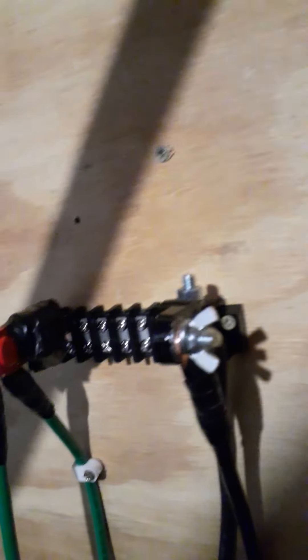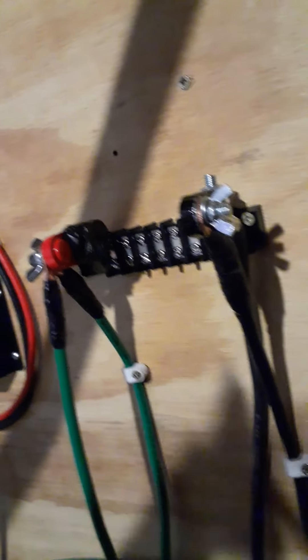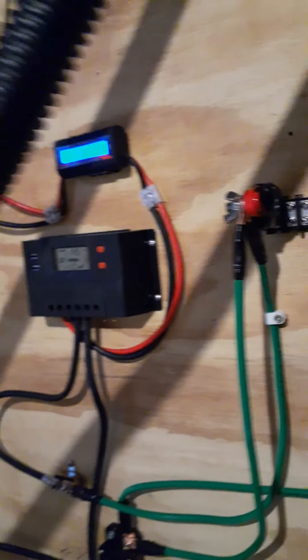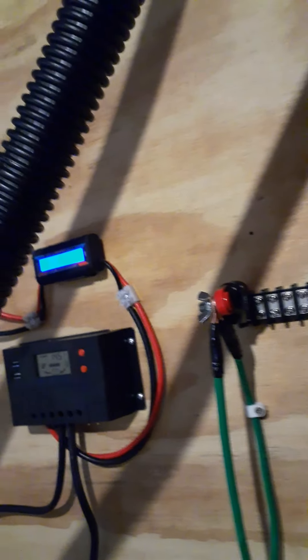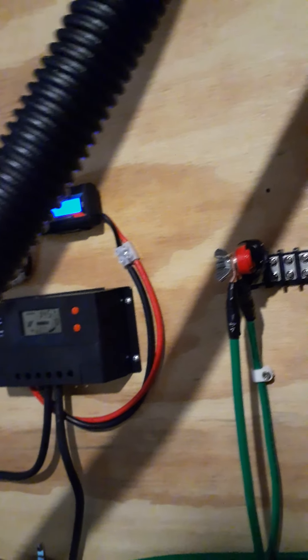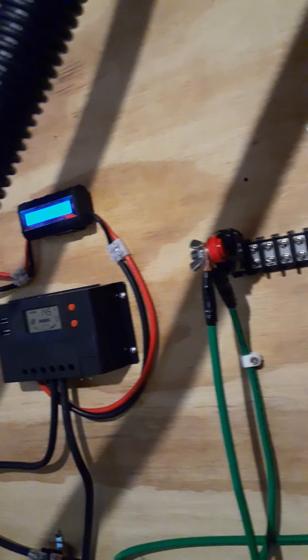I made this custom piece — I took two strips of copper, bent them into an L-shape, and separated them. These terminals are rated up to 600 volts so I figured as long as the two pieces don't touch, we're fine. I'm going to tape more of it up today but I left it open for now. Check out that DIY Solar Power with Will Prowse channel — he tests solar panels from different manufacturers, measures energy output and production. Excellent stuff.